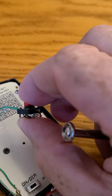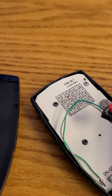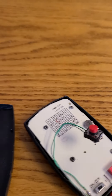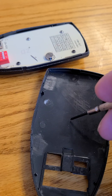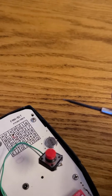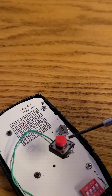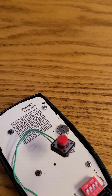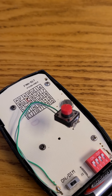I found a little snap-on button switch on Amazon. It just comes with a short black button, and it didn't quite reach through the back panel — this back panel is a little thicker than the button could reach. So I had to make an extension, and since I have access to a 3D printer, I printed out a button extension to make it reach through the back cover.